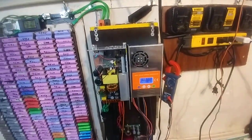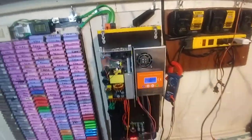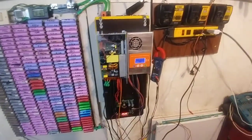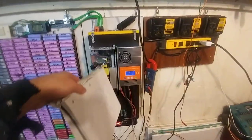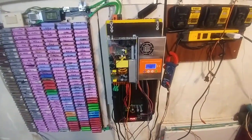That solves the problem, but I was already stuck on this little venture where I figured I could just have this going to this instead of having the power brick. But at the end of the day you're just better off with the power brick and then this going to solar, so that you're not possibly breaking your MPPT by shoving electricity into it that might not be good for it.